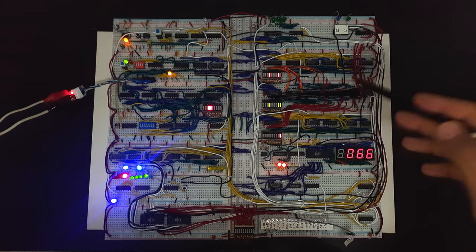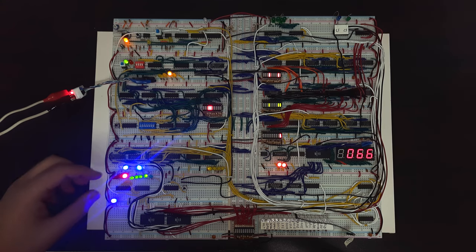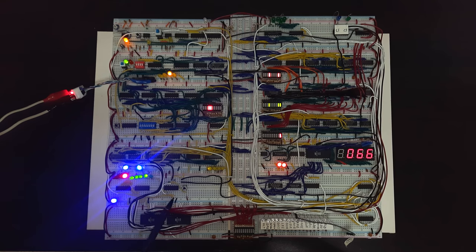We wouldn't load a value elsewhere or corrupt something in the circuit. So basically this part kind of counts which micro-instruction we're in. And we have the reset button here, which resets everything to zero so we can start executing at the first address of the computer. So it counts and tells us which micro-instruction cycle we're on.